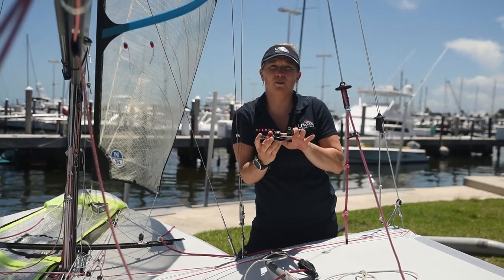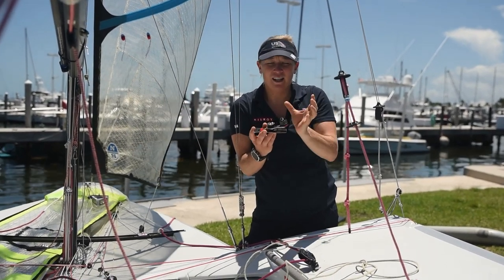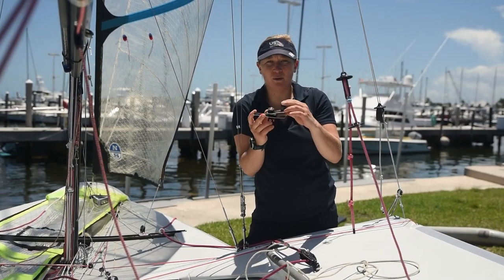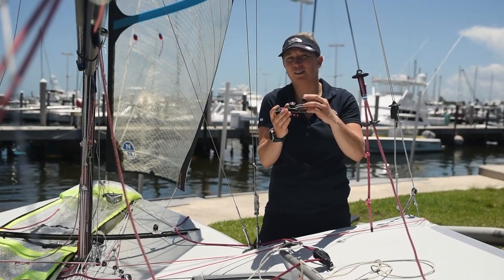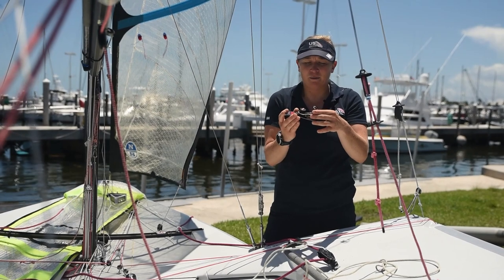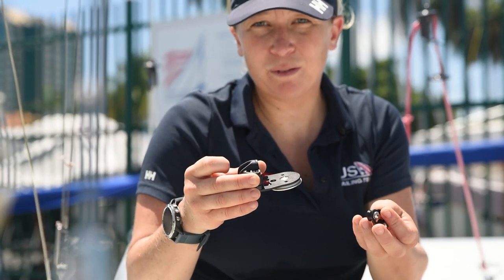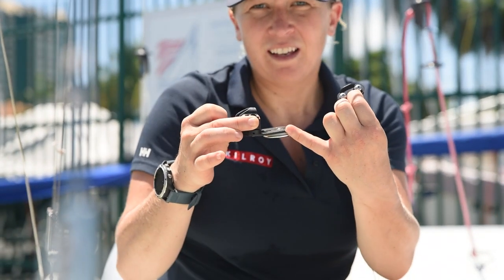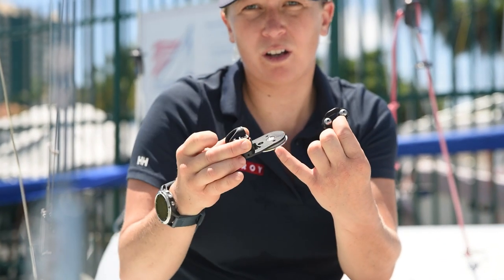It's a pretty brilliant piece of engineering — basically the height of this jib cleat is adjusted with an allen key wrench and a small sliding piece. You don't actually have to compromise the equipment to change the angle of sheeting; it's designed to be changed with tools. I don't have to step on it or pull it up and risk breaking the equipment at a critical moment. This is the old piece we've just taken off, and you can see that the platform — the arm that the cleat sits on — is fixed in space, so we have to physically bend the metal to change the angle of sheeting.